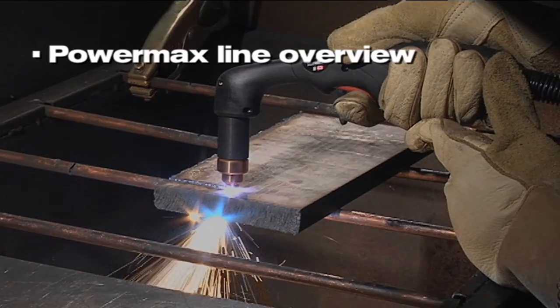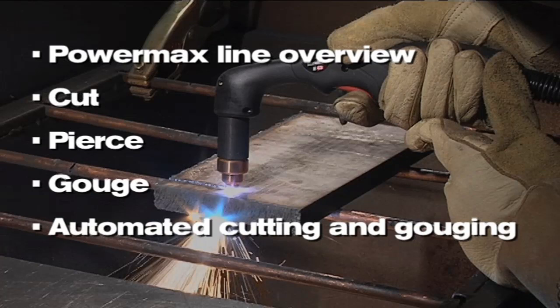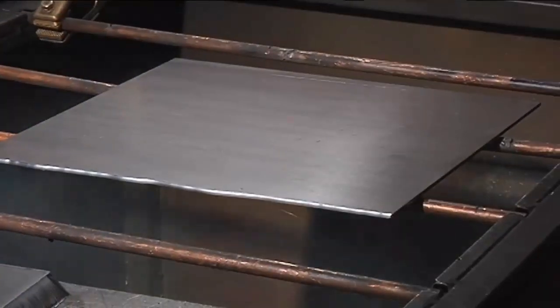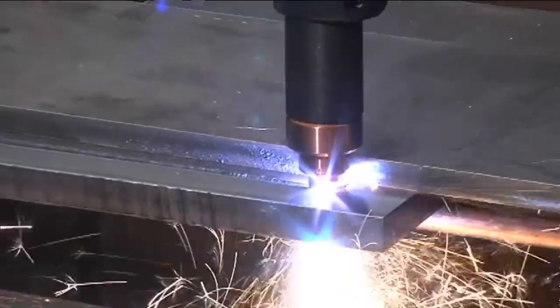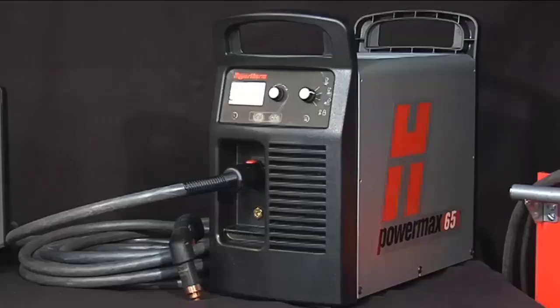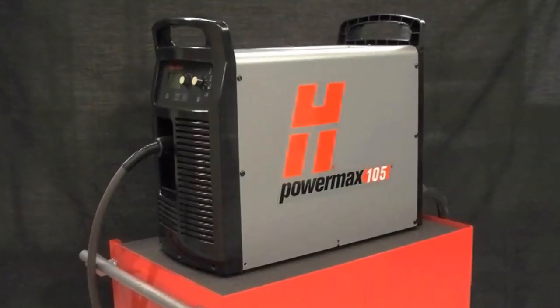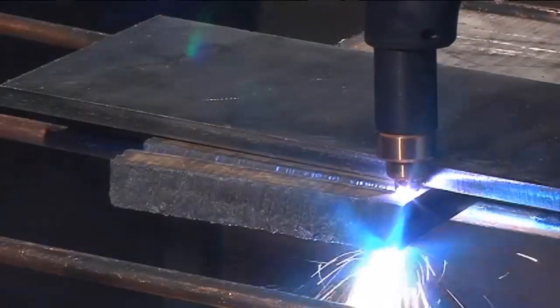Over the next several minutes, we will introduce the PowerMax product line and show you how to cut, pierce, and gouge with hand torches, as well as how these systems can be used with automation equipment. PowerMax systems are used to cut and gouge a variety of metals and thicknesses. They use the intense heat of a plasma arc to melt metal and ordinary compressed gas to blow the molten metal away. Hypertherm makes five PowerMax models, ranging in amperage output from 30 amps to 105 amps: the PowerMax 30 for handheld cutting, and the PowerMax 45, 65, 85, and 105 for handheld and mechanized cutting. PowerMax systems make high-quality cuts on metal thicknesses from gauge to 1¼ inch, and can sever metal up to 1¾ inches thick at 100 amps.